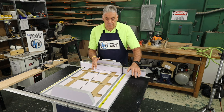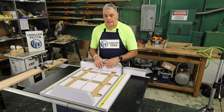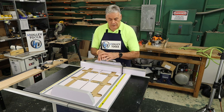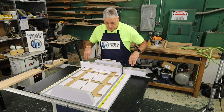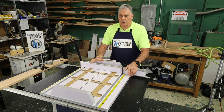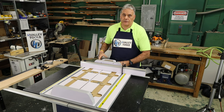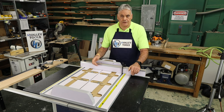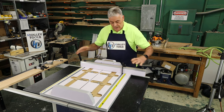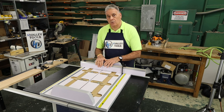The most important thing for us was stability, which meant that it was beefy and solid and that it was safe. Most times when you have a cross cut sled they were basically a piece of plywood, a bolster, a handle, you cut through it and that was it. We didn't want you to cut through the back of the sled for safety reasons — that requires a safety box. Everyone forgets it, they nick their fingers and we didn't want that. That's why our rear bolster is the handle and there's an accessory fence in the front that lets you see what you're doing and know where to stop.